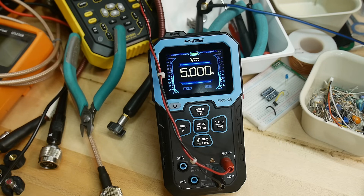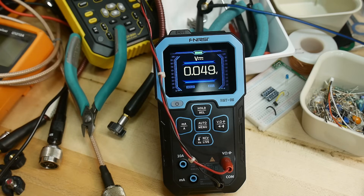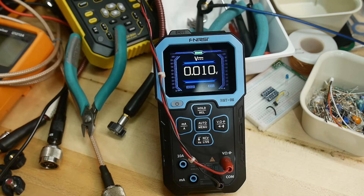Now let's get right to the problem with the meter. At 50 millivolts it thinks I want to measure ohms, so we need to manually switch it to volts. There's a threshold of around 0.8 volts — above that it will auto-detect voltage; below that it won't. There is no millivolt range, which is a big fail. It only has a volt scale, so it'll show one millivolt but only on a volt scale.